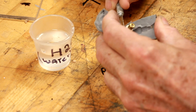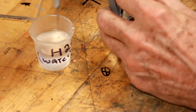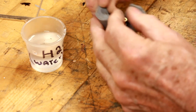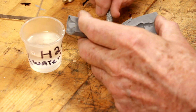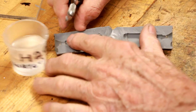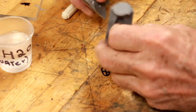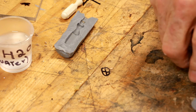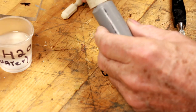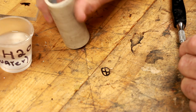As you're pulling and keeping pressure on the mold while cutting, if you stretch the RTV enough you'll see a white frosted color on the rubber right before it tears. That white frosted area is where you want to focus with your knife — go right across there and follow that white and it'll cut clean. You can leave that last cut as a butterfly so the mold comes in two hinged parts — it helps registration a little bit.